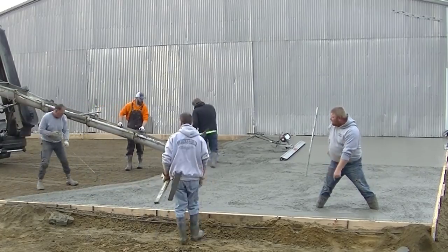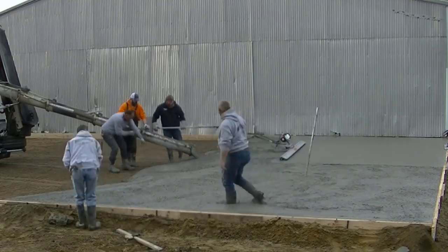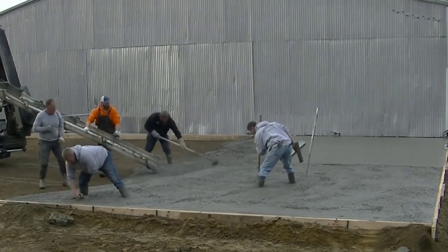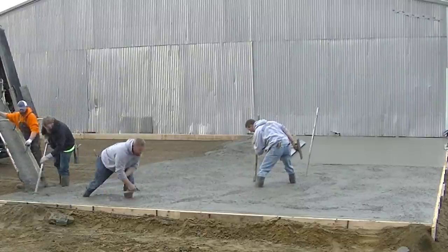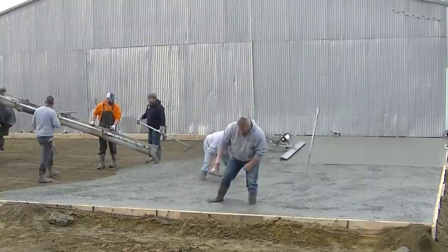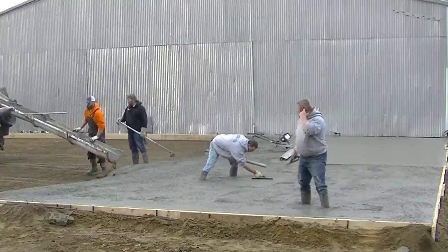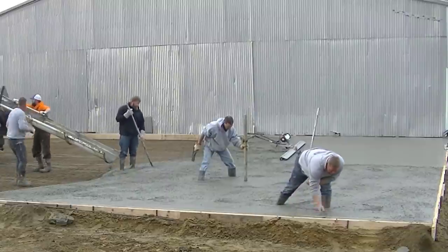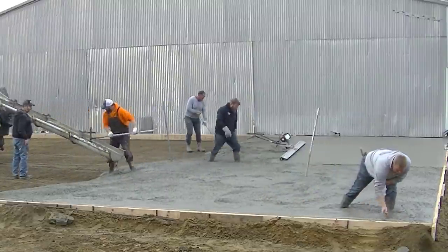The third truck will dump out over there to the left, way up against that other old farm building, but we'll also move it over here against this one. So we'll maintain a wet edge with this third truck against both the previous trucks — and that also helps with the finishing process, making things nice and even when you finish the floor.